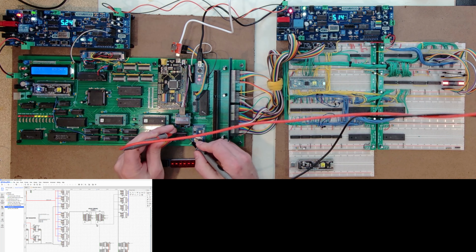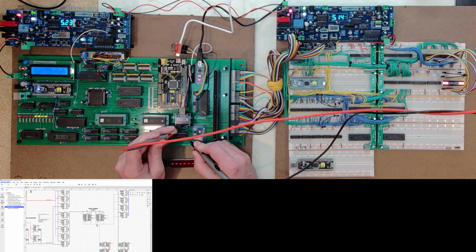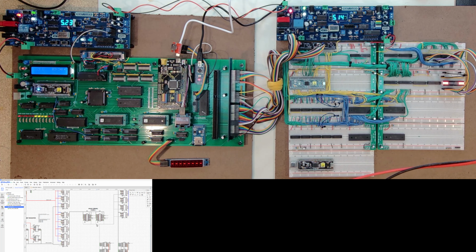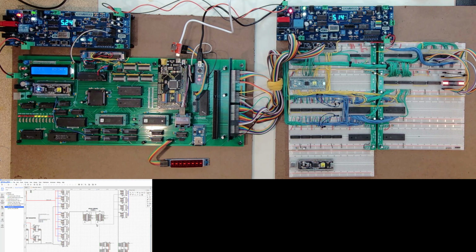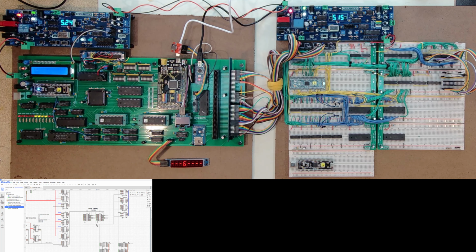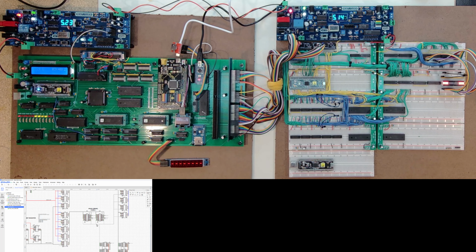And it looks like this is going to be my continued challenge area. At that point, I'm 4.96. So that's probably good enough. But that kind of takes me back to the voltages like what I was seeing before. So I just know that the voltage drop is the greatest down here. Let me just do a power off and power on, make sure things still work at the voltage I now have things at. So it's counting down through my RAM testing and passed all my tests. All my RTC, my real-time clock, temperature, all that stuff's working, register's working, so that all looks good.